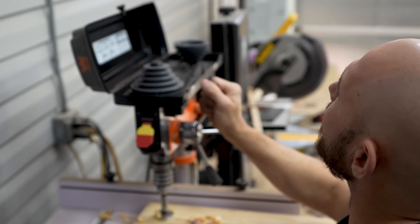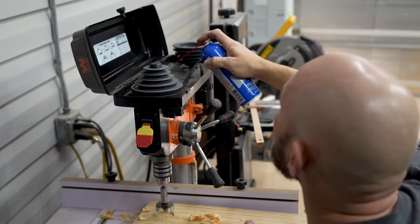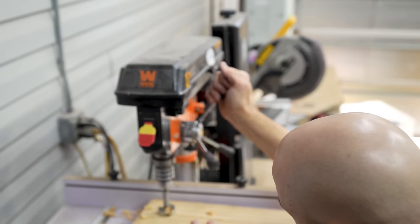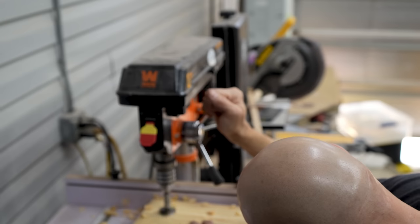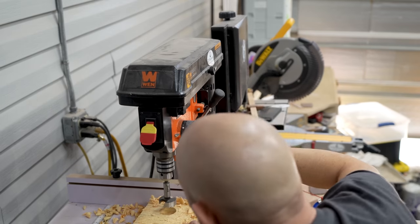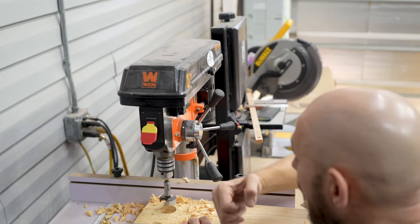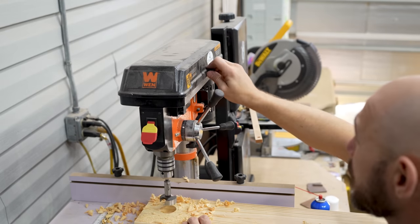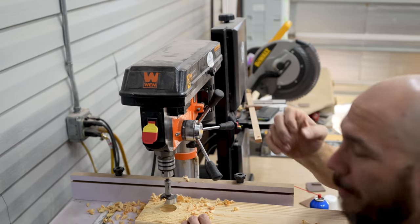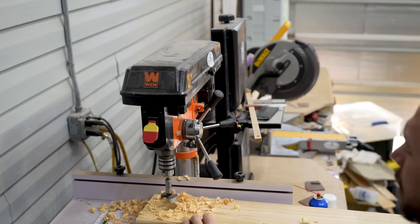I can actually make the drill press stop — it's the power of the motor not having enough to pull everything. After applying the belt dressing, it actually worked. When I really pulled hard on it before, it would stop. Now it doesn't. I've had this problem with this drill press ever since I got it — it always felt a little underpowered, but it was just the belt slipping.